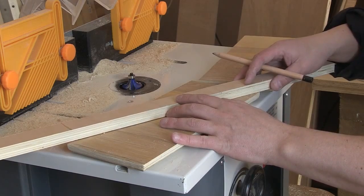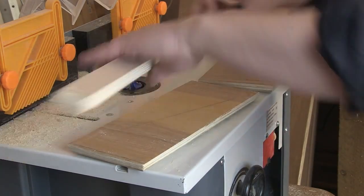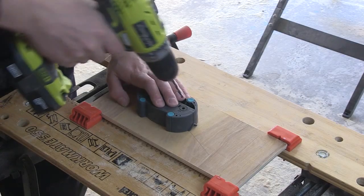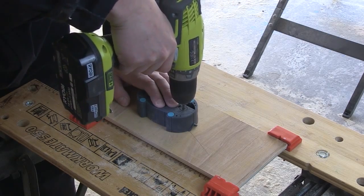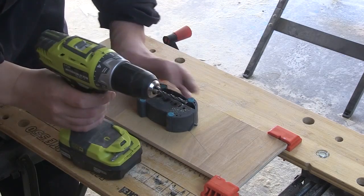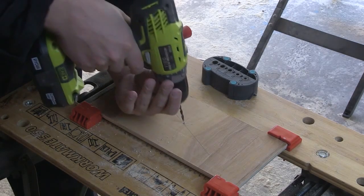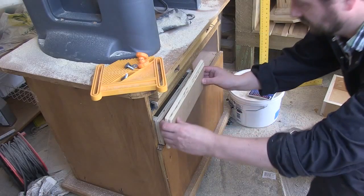Using a scrap piece of wood I find the centre on the back of the drawer faces. I'm going to drill a hole through these and that's how I attach them to the drawers themselves. I don't have a drill press so I was trying to use a jig that I bought — the idea is it will keep the hole square to the piece of wood you're drilling through. The problem was I couldn't get all the way through the jig and the scrap of wood; however that little pilot hole was just about perfect to keep it straight as I finished off the job.